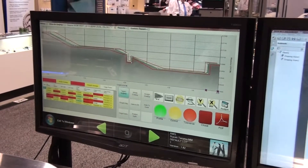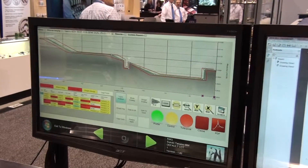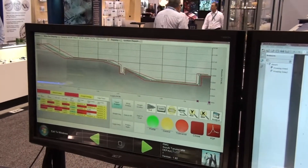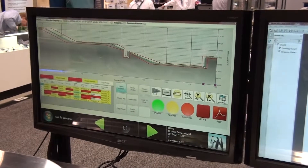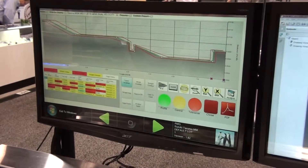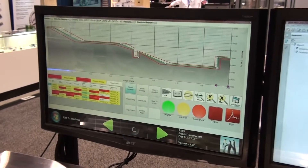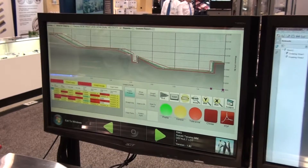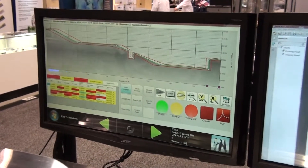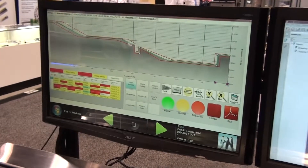You can enable or disable the control limits, print offset values in color, view on-screen offset values in color, and use the movable datum point feature. There is an adjustment limit feature using yellow tolerance lines, and pass, pass-adjust, and fail indication for operators using algorithms. A measurement summary report with export to CSV capability is included.